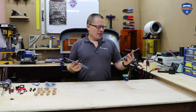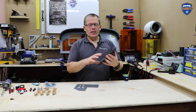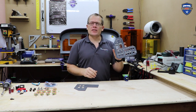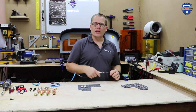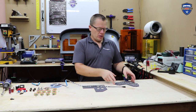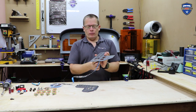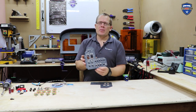Next up is the avionic panel. I've created it in grey PLA with raised text and then used a paint marker. It is designed to be backlightable if you can go through the hassle of doing that. You would print the face panel in white, spray it grey, and then sand off the top layer with the raised text to reveal the white behind it. To make it backlightable, you would place your 12 volt LED strips in various positions, hidden by the recess in the back of the face plate. I'm more than happy with just using a paint pen on raised text.